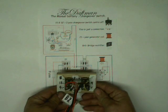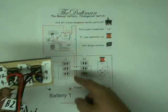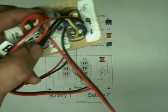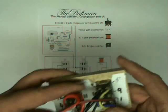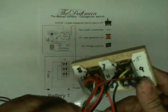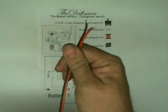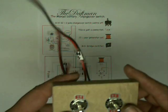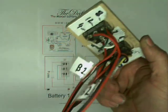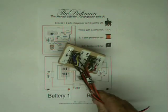The wiring is very simple. I mounted them on a board — there are numbers on the diagram and I put the same numbers on the back of this, then wired them up accordingly. Basically all you've got is a link from there to there, a link from there to there. That becomes the input — you could put that directly onto your charge battery; in his case he's going to put it to a bridge rectifier. That one would be battery two, that goes to battery one, and that goes out to run the Bedini itself. This could all be done with one four-pole changeover switch; I didn't have one so I used two two-pole changeover switches. It can also be done with a relay or a battery swapper, but we're going for the mechanics to keep it simple.